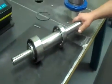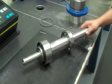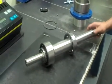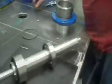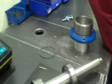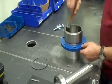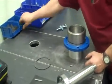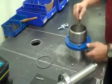We get our shaft — this shaft is a 24000-01-02-31-8 rotating assembly, and it's a solid shaft. The next thing I do is lube the inside of this bearing housing. You don't need to use too much; it should slide down easily, and you're going to lube that little O-ring inside too.